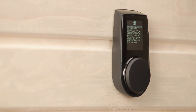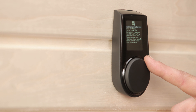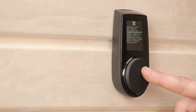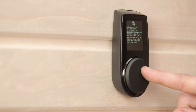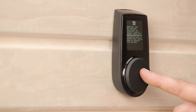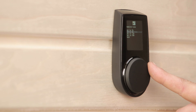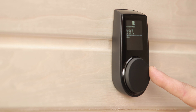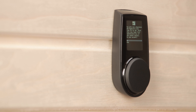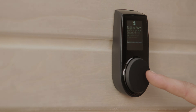If you've connected your lights or ventilation inside your sauna, this can also be activated from the settings menu. Once that's done, all you need to do is press the dial two times when you want to switch them on or off. You can also select the heating time instead of remembering to switch it off, which is particularly useful for public saunas. There are options of three and six hours for private saunas, 12 hours for semi-public saunas, and 18 hours for public saunas.